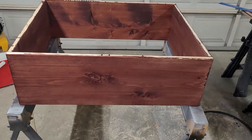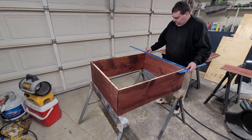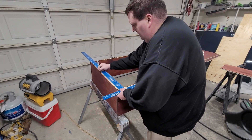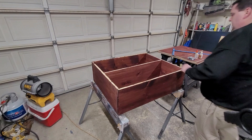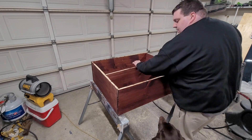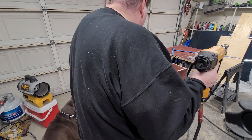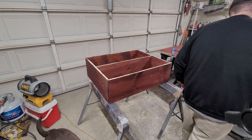We start out building a basic box — 36 inches on top and then 27 and 3 quarters on the sides. Here I'm using the T-square to mark the center so I can set my shelf going straight across. I'll use my framing nailer to put one nail on each side to temporarily hold everything in place, then use a square or a level before putting a second nail in just to make sure the shelf is good and level.